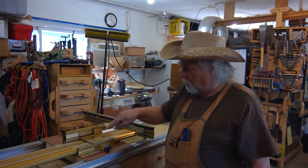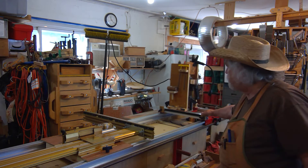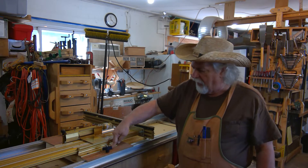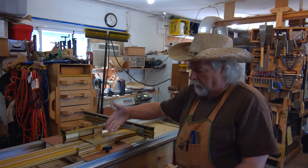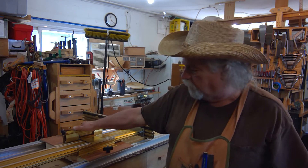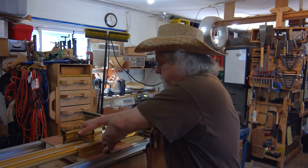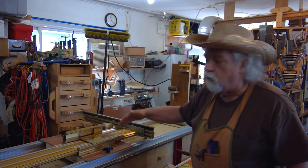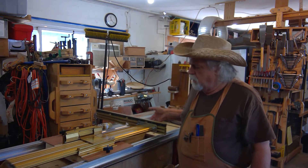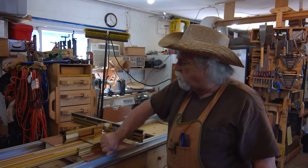What I did was mount the carriage onto a plate that sits on the top rails, just like the router carriage sits on the top rails — so does this now. I've got a board underneath here so that when I'm ready to set this square to the x-axis I can hold the machine, pull it toward me, and that board contacts the top rail. I can snug this down, tighten the other side, and I know I am now parallel to my x-axis. As this moves, it stays parallel — quick and easy.